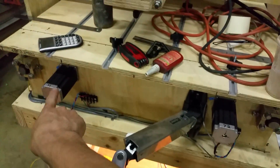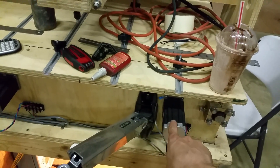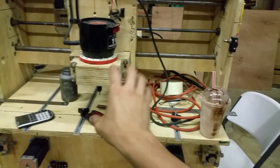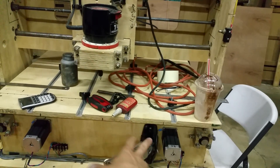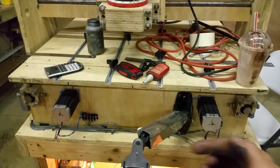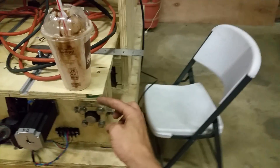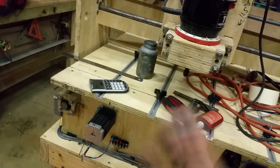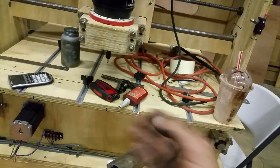I was also having a lot of lost steps in the Y-axis. The Y has two motors — Y1 and Y2 — meaning two lead screws driving the whole gantry side to side. If one was losing steps, by the time I went back and forth a few times, I was off about a half inch measuring from edge to edge comparing both sides. After doing the grounding and adjusting motor tuning parameters, that's been resolved.